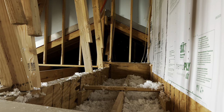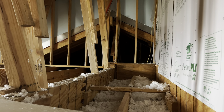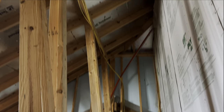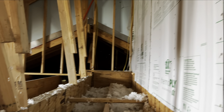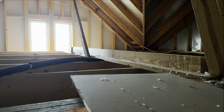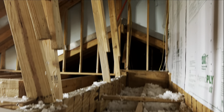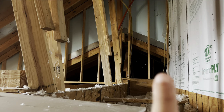This is the attic space — pretty typical for a three-car garage. I will not claim I did any of this work; this is done by Crown Electric out here in Houston. They're available for hire anywhere in Texas — I'll leave their information in the description. As you can see, they've already got the yellow Romex lines in: one, two, three on the left side and one on the right side, going all the way up to the top. These are 240 circuits going in for the subwoofers as well as the black swans I have planned, and that smaller one is the dedicated 20 amp circuit.